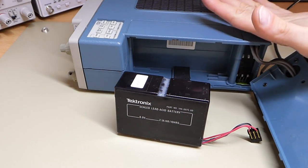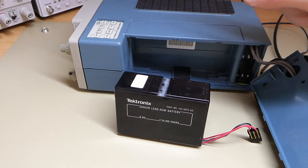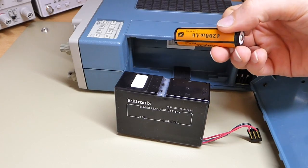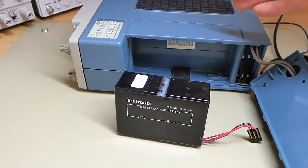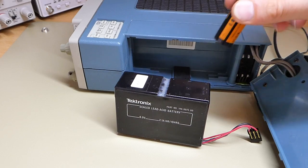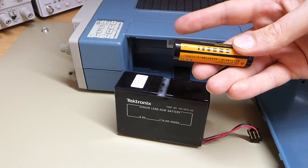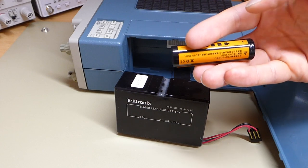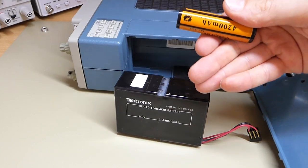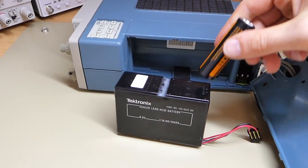I'm not planning to go into any of the design details — I've written all of that up on my website, so if you are curious about the actual circuit please go and have a look; I'll put the link in the description. The main problem is that lithium cells have a voltage of normally 3.6 volts and want to be charged at 4.2 volts, while the scope expects 8 volts and wants to charge the battery at 9.5 volts. Conceptually the solution is very simple: a battery charger that charges from 9.5 volts, a boost converter that outputs 8 volts, and a comparator that switches between charging and supplying power.